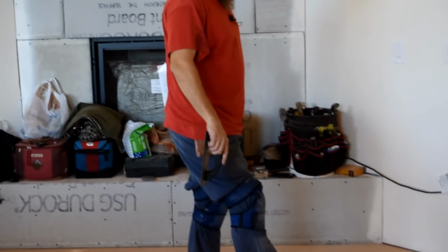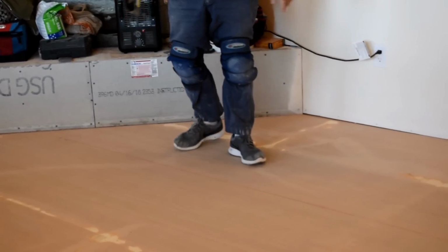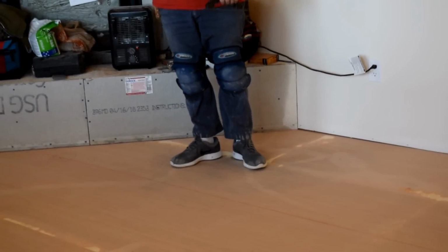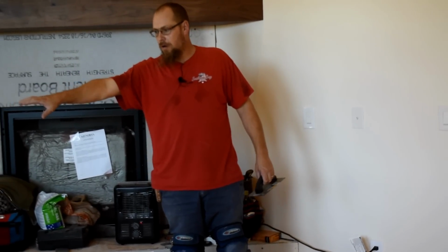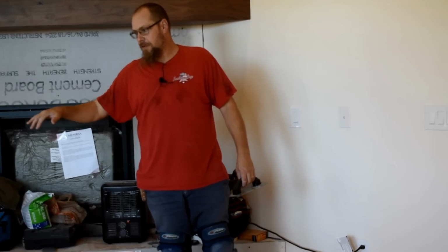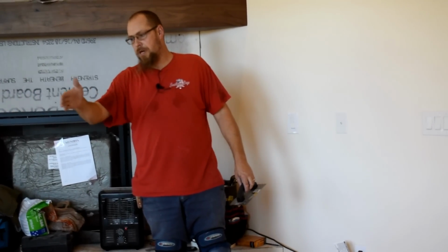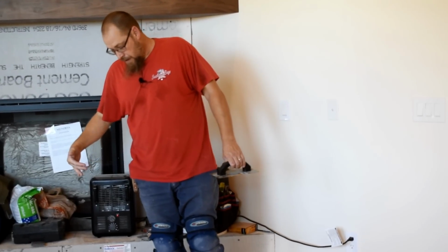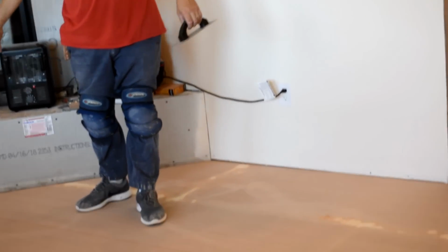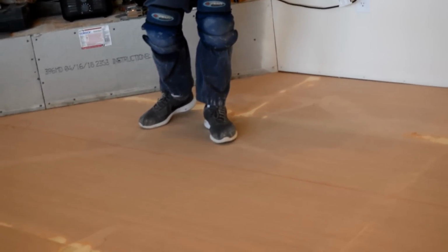So we got our underlayment down. We got us a chalk line popped here. I measured, because nobody's perfect. I put a straight edge against the wall over there and measured off of it to get me a straight reference from the bows in the walls. Same thing over there, and then I measured over and popped me a line 10 foot 5 and a quarter inches all the way down through there. So I'm gonna focus on this part first.